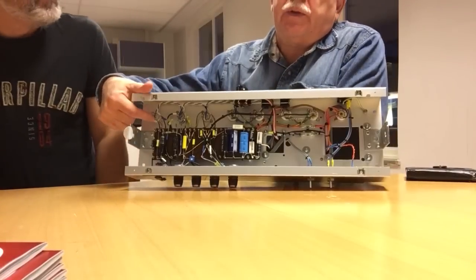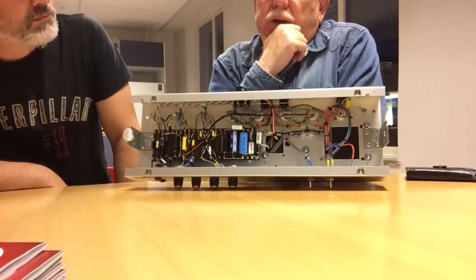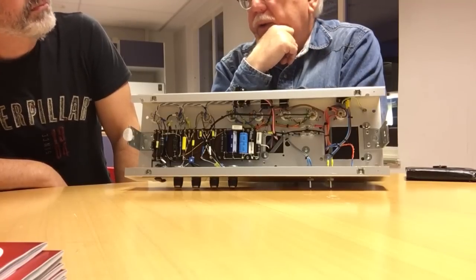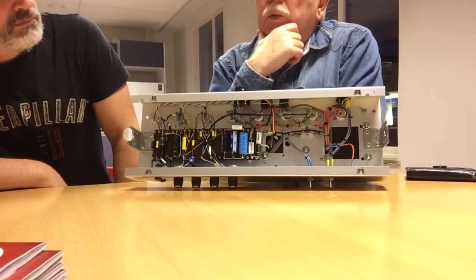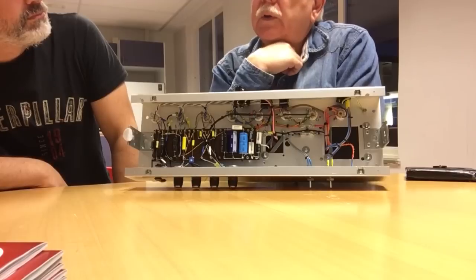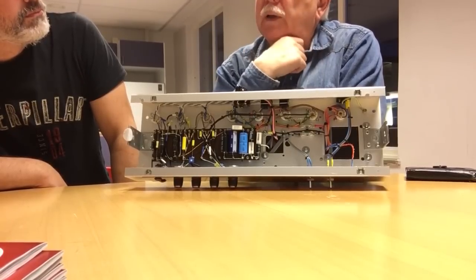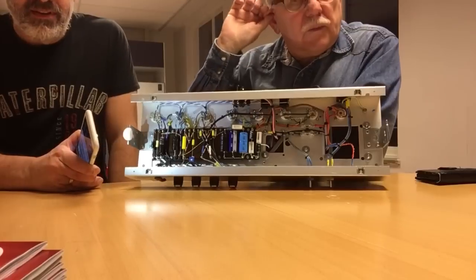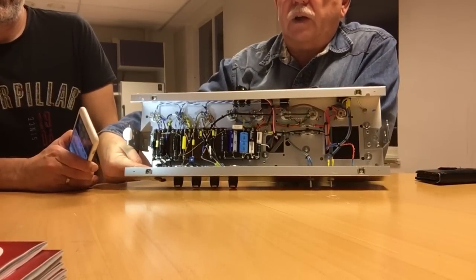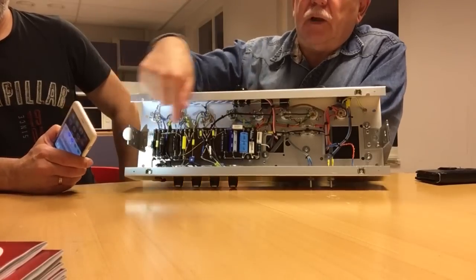On the first tube, that's the input stage. That's the only thing resembling an 18-watt Marshall, with two triodes in the first tube, jumpered so that they work in parallel. That's all. The signal goes in there through the jack socket, and basically goes all the way through.